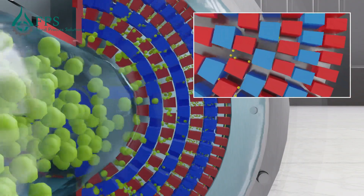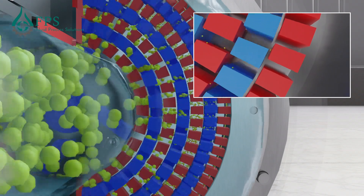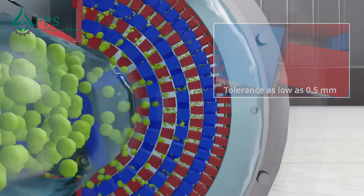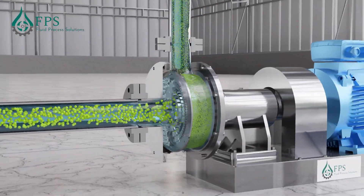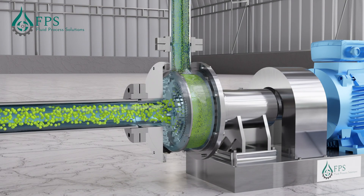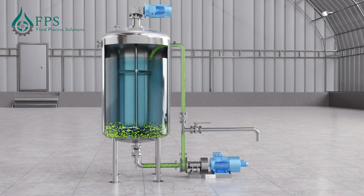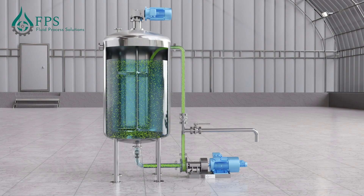The high rotational kinetic energy is converted to heat energy due to disruption of the material flow in between the tolerances of the rotor and stator. The sheared material is then projected outwards to the mixing vessel, while fresh material is continuously drawn in from the mixing vessel, resulting in a continuous pattern of mixing and pumping.